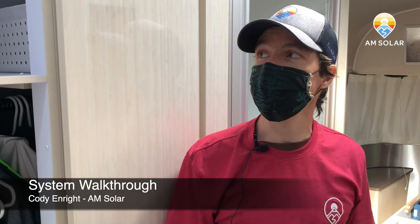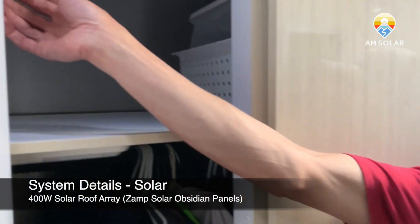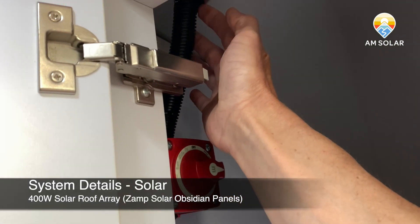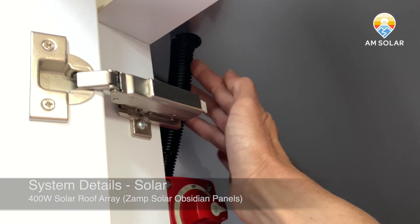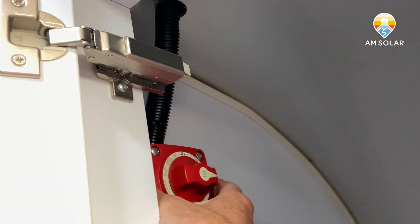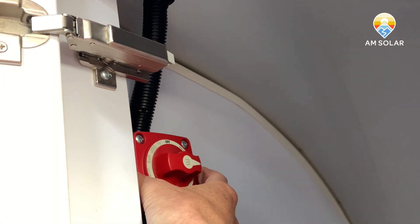Before I demonstrate some load use and potential of the solar system, I'd like to drain the battery some. In order to reactivate the solar system, one key move is to trick the charge controller into believing it's nighttime. We do that through our system design — we include an on/off switch for the solar panels. This is the common location in Airstreams because we route our wires through the ceiling. We interrupt the positive of the MPPT through this switch, isolating the solar panels from the charge controller, which is the same as nighttime.